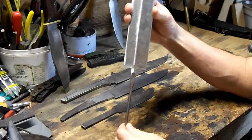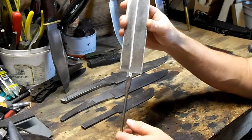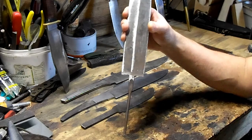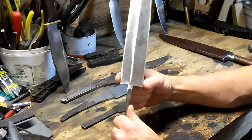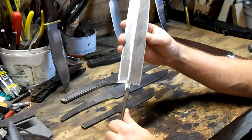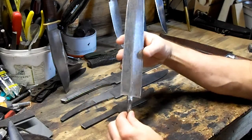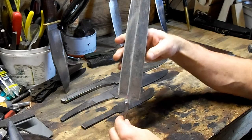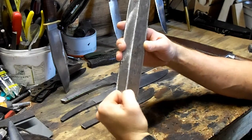This is what was commonly referred to, or might still be referred to in many circles, as a rat tail tang. If you hear that the narrow tang has a bad reputation, it is likely due to this kind of tang here. If we look at the bad points about this tang, the blade is fairly wide but narrows down abruptly to a very narrow tang — it's not even 50% of that blade's width. The tang transition area, where it goes from a blade to a tang, is non-existent. There should be as big a radius as can be right in there to absorb and distribute the stress throughout that area.